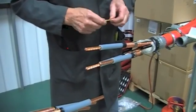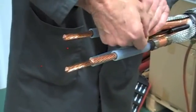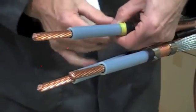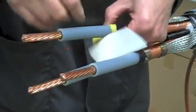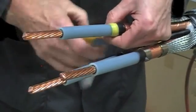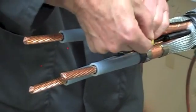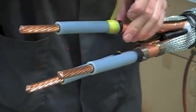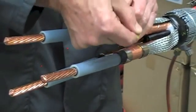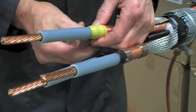Now take the yellow stress-relieving mastic, apply with a thin edge, stretch and extend onto the primary insulation by 10 millimetres, back onto the semi-conductive layer, and just catch the copper tape screens to keep them in position. This mastic tape will also provide a moisture seal when the stress control tubes are fitted next.